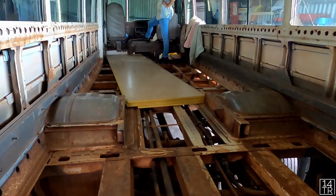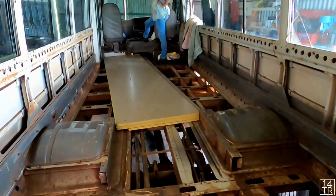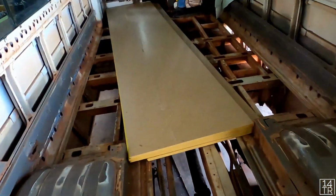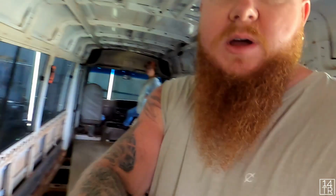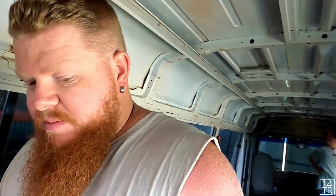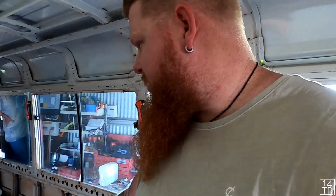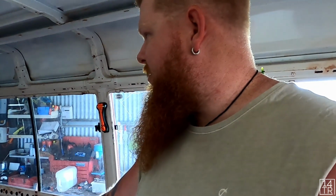So they've got a little bit of weight in them, but they're the same size, thickness and whatnot of the boards that we ripped out last week. What we found last week when we were doing the floor down here was that from the existing aircon unit, there was a bit of a leak. So the flooring down here was pretty busted anyway. It was rotten. So we've ripped that out and we've got the same mill. I think it was, is that 17 mil? Pretty sure it's 17, I'd have to look at the receipt of the stuff.